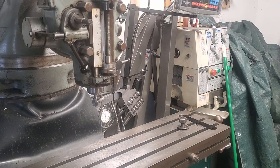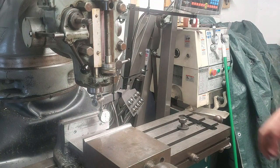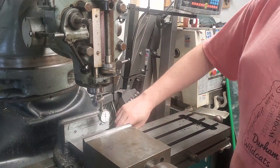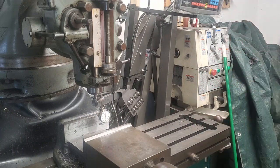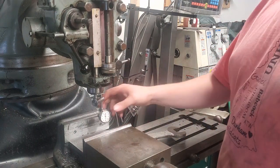If you're watching this channel, you're very likely a hobbyist — you're not a production guy. So excuse me while I give myself a hernia loading the vise on. There's a nut that is in the dead center of the table — I want to say it's a 5/32 screw. I'm not going to show you guys oiling that, I'm just going to tell you about it: take your vise off regularly and oil that.